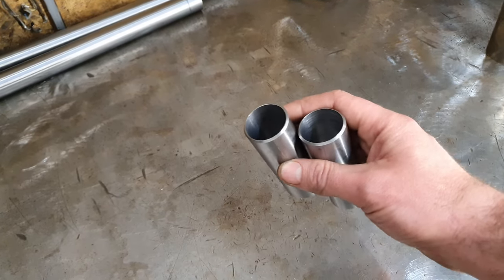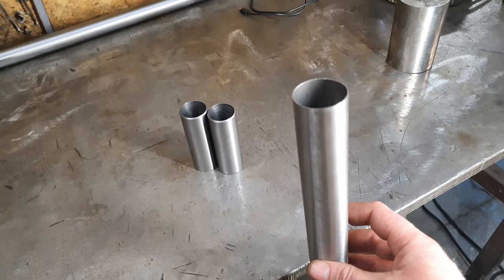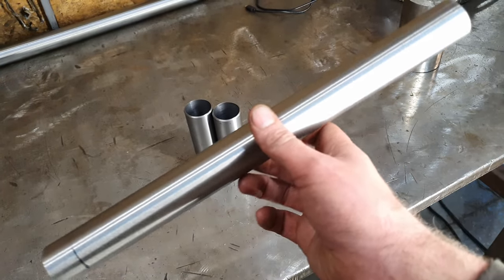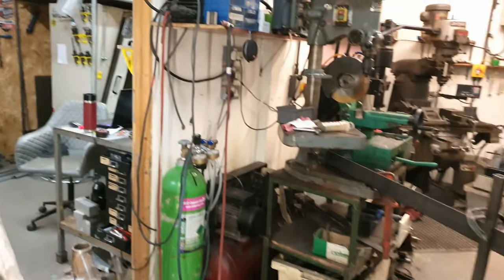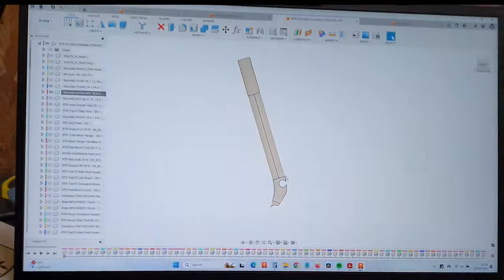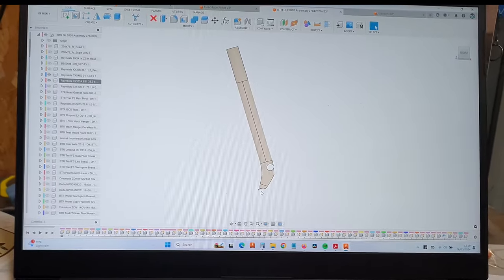Now that I've got those two toppers sorted for the seat tubes, we need to actually bend the bottom bit of the seat tubes. It's 35mm by 0.9mm wall 4130 tube. The seat tube on the Gasser gets bent forward so that the main pivot can get drilled through the seat tube, and then the bottom of the tube can meet the bottom bracket.